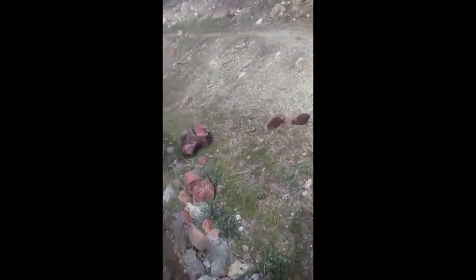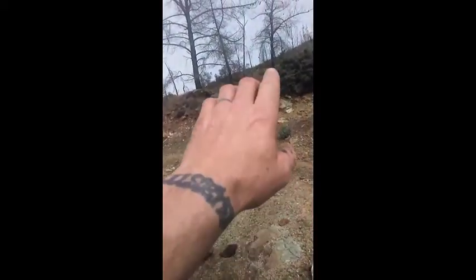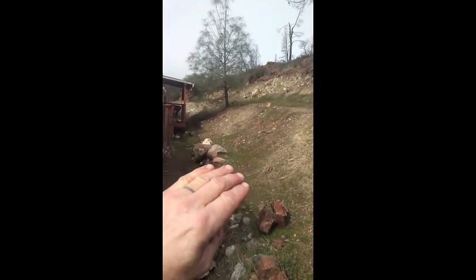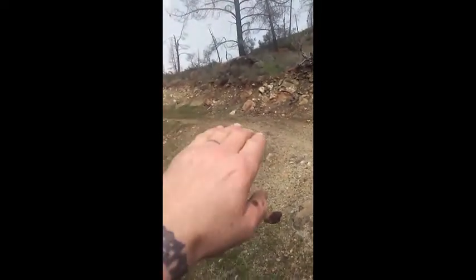So this is another spot where we're going to use the rocks that we're pulling out of the culvert up the road. There's a cut here and then a flat and then another just raw slope, so we're going to build a little wall and then another slanting one to catch water off of it. It's not really the spot where we can do much of a culvert up here.